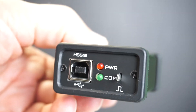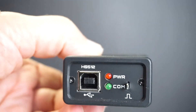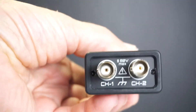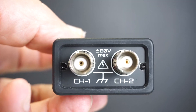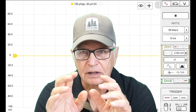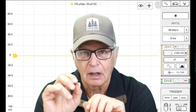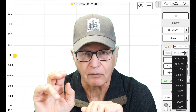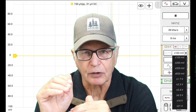The HS series oscilloscope now sports this new look. Here's the USB end, and here's the BNC end. The input is 80V max — that's actually a working range. That 80V working input is divided into 12 ranges, from 80V all the way down to 100mV.